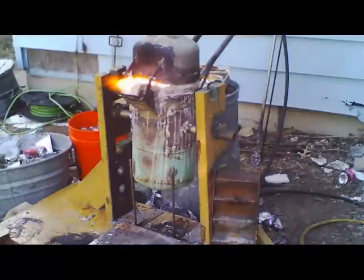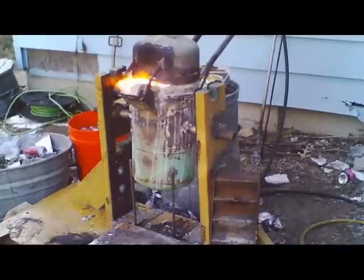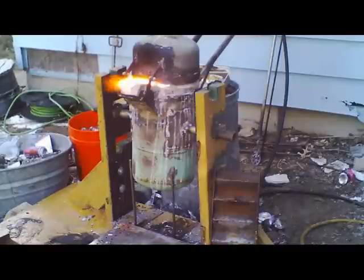Go in and stir it up again. Now comes the degasser — take your baking soda wrapped in aluminum foil, two tablespoons of baking soda wrapped in aluminum foil. Stick it inside that tube and jam it all the way to the bottom of your pot.